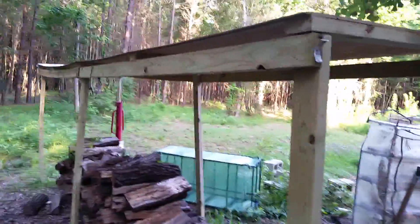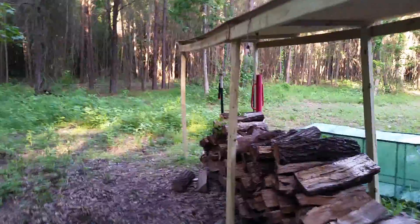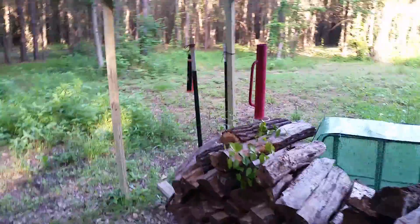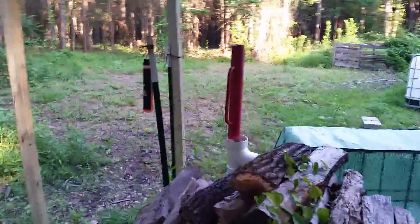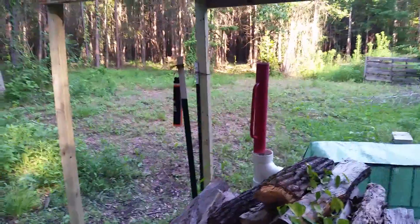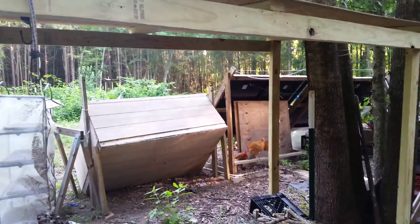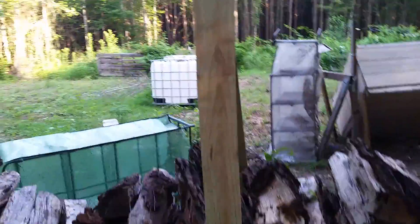But I digress — my woodshed is just six-foot-two before standing up, and across that way 16 feet long, four feet wide. I built it and it fell over because this end over here wasn't secure — it wobbled back and forth, so pretty much the first good wind knocked it over. So I anchored it with a T-post driven in the ground and a two-by-four tied to the T-post. I'm thinking I might have to get a couple more pieces of siding and redo it, make it eight feet wide to help keep the rain off the wood.